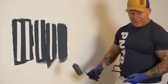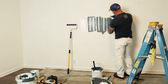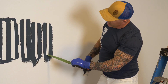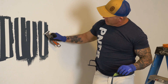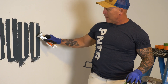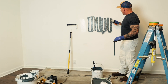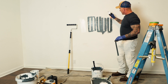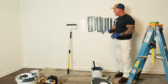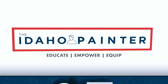I'll show you if you're really particular about pressing and using your fingers what this will look like. Peeling this off — let Frog Tape do the magic. You can see I was pretty particular — I had some bleeding spots right there. That's pretty impressive for Frog Tape without any caulking. But if I had to have a laser-straight line, I'm going to have to fix those couple of spots. Versus something like that — laser-sharp. So there you have it: tips and tricks for why paint is bleeding underneath your tape and how to resolve it using Frog Tape or caulking over your tape.